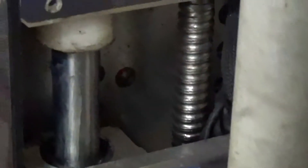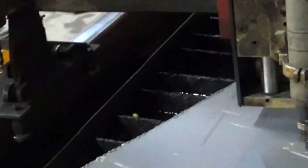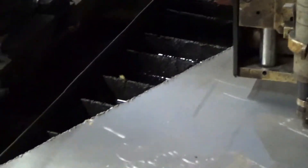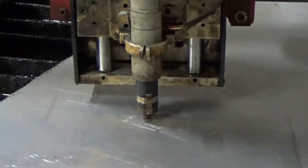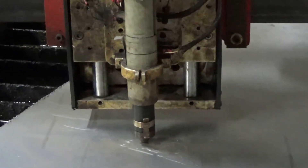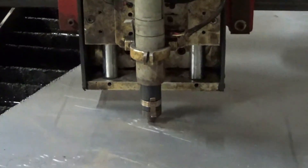I've re-plugged this in. The slides are as clean and greased as I can make them. I cleaned the slides, cleaned the ball screw. I've been having this problem for a year now and was told just to clean the slides. It never did work correctly — every once in a while it's not going to the correct pierce height. I need to get this fixed because I just can't work with it anymore like this.